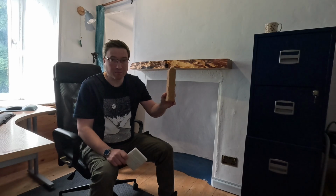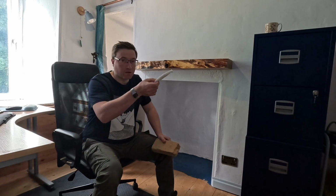In the last video I showed attaching 4 centimeters of Gutex wood fibre insulation onto the stone walls. That's great for where you've got a flat surface, but I uncovered the fireplaces here and they're not entirely flat. So this is too rigid for it. In this case, I'm going to use aerogel fibre, 1 centimetre thick, to insulate it where the stones are a bit more bumpy.